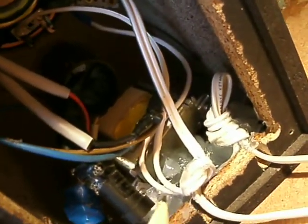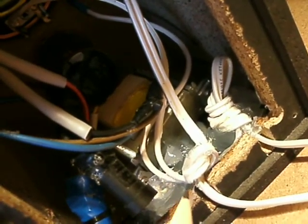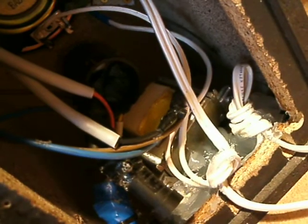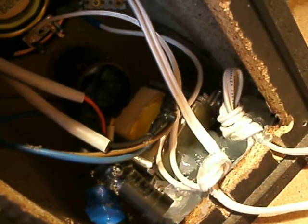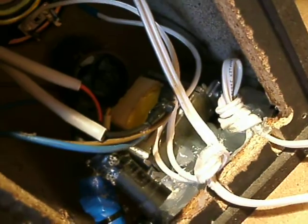You have to be aware that the transformer must be moved in all directions inside the second box, and then you must listen with your ear at the speaker. At the same time, move the transformer until the hum is not audible any longer, and then fix it with pieces of metal or silicon kit. That's one advice.